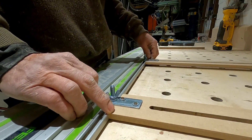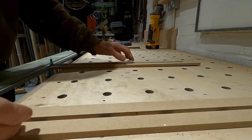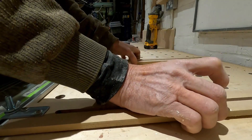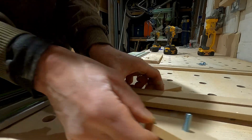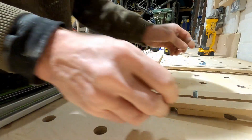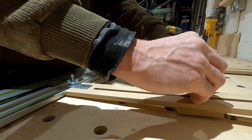They're tightly up against the rail. What I need now is two stops on these ends so that when it's hooked over the sheet you can keep the cut parallel. I've drilled a hole in a couple of pieces of MDF, just in the center, and I'll now put that in under there and just put a wing nut on.